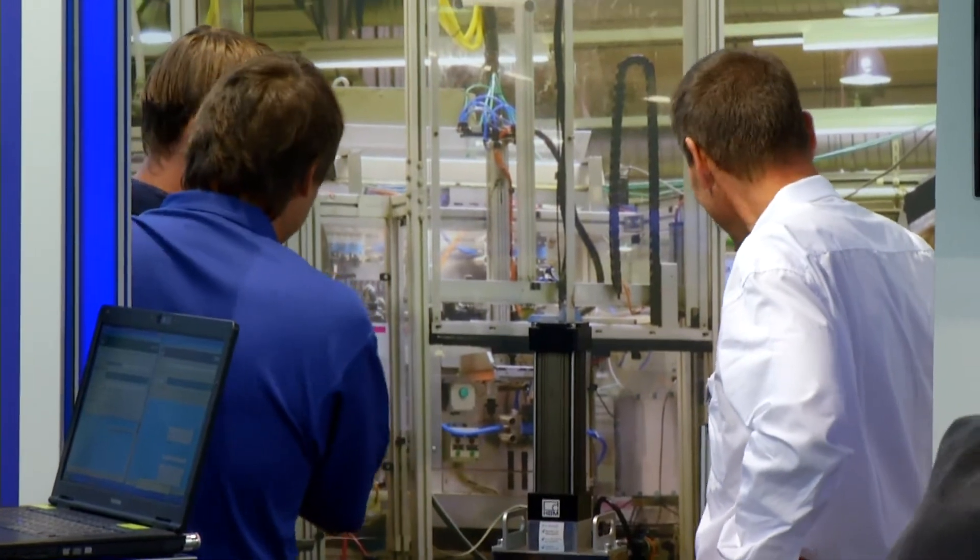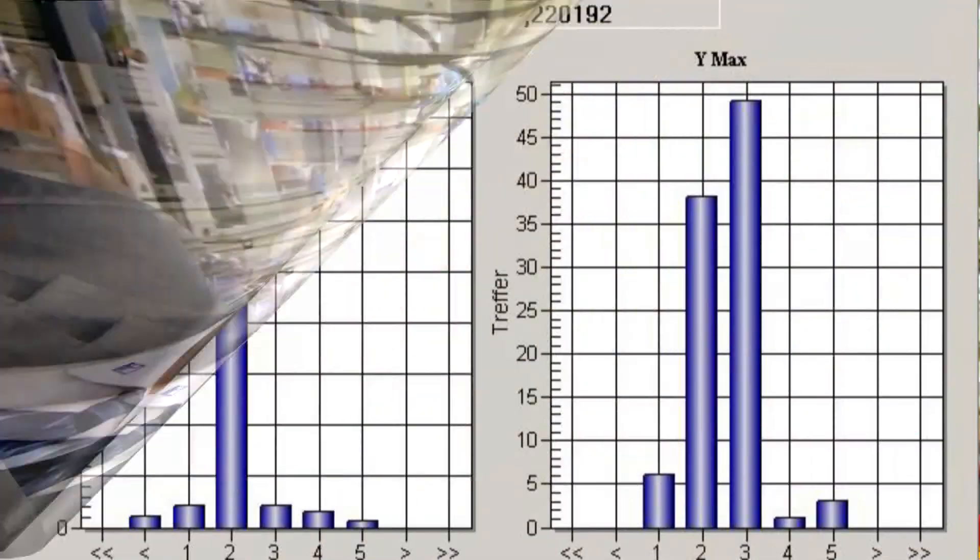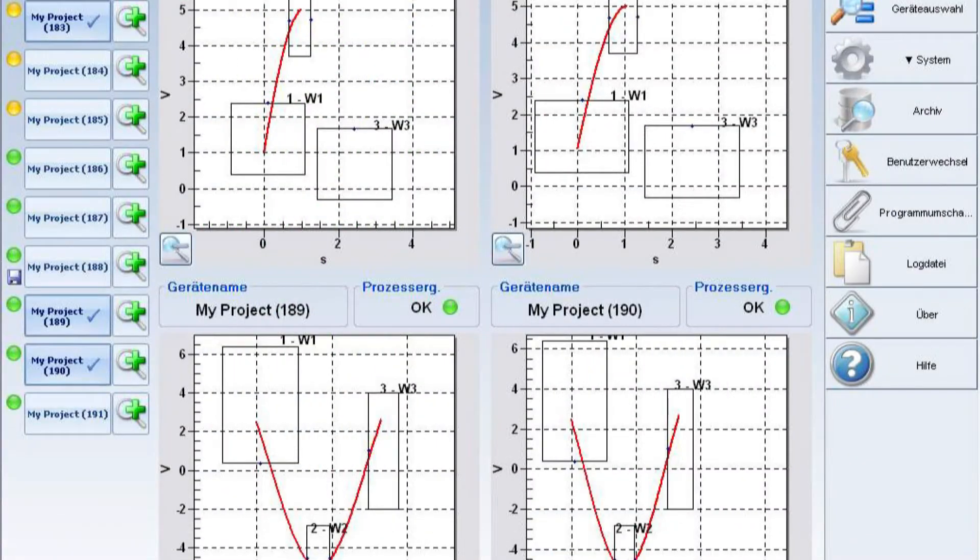These characteristic points of a production process can then be evaluated with the tolerance windows or tolerance ranges. Once these evaluation methods are found, they are stored along with the process graphs, important for the quality data division of a production. These windows and process ranges are later played back in the process controller MP85A in order to monitor and secure the quality during the production operation.